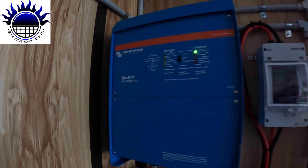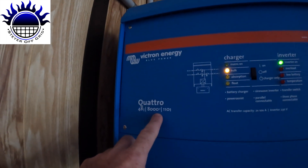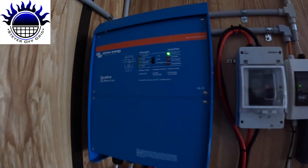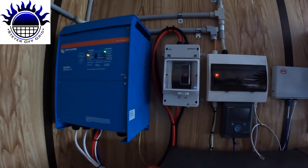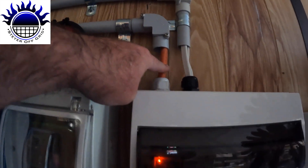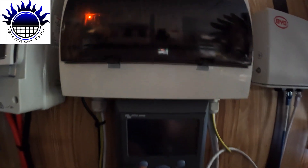It's an expandable system and it's overkill for my caravan obviously, but it's for the shed home later — very expandable, so I can do whatever I want. In here we have a Victron Quattro — it's a 48-volt, 8,000 volt-amp, 110-amp unit. With this system I could actually get another two of these and have three-phase. The cable coming from outside comes in here to a power meter, which then through Bluetooth goes to this meter down here.